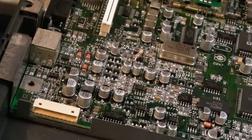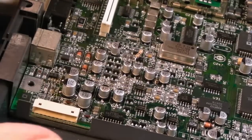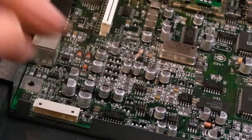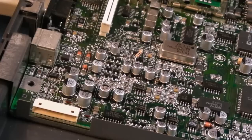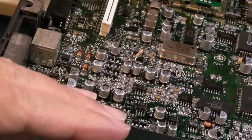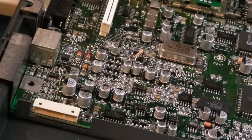Right, so here we are back in pieces again. It's working fine. Well, I say it's working fine. It's super sulky with the TF330. I have cleaned the edge connector up, cleaned the adapter, the backplane thing, and reseated it so many times. What happens is the power light stays dim, like it's not received the reset. And then I was messing around with the jumper on the Terrible Fire, the disable pin, and that seemed to make it work.